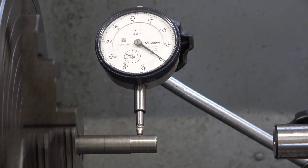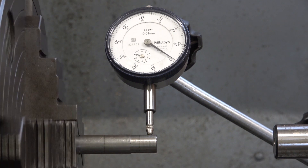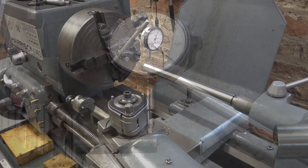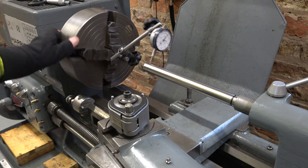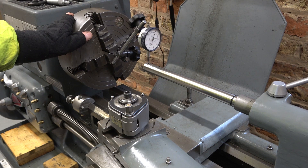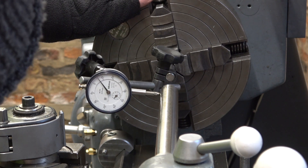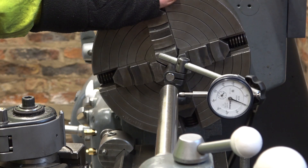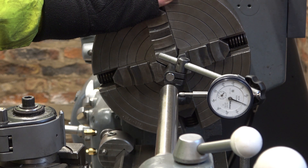Well that's better. Let's just move it along and see what happens. Even there it's run off a little bit but it's near enough. Okay, this is the setup and I'll look at the clock. I'll read those off: zero, six, six, nearly zero — one in fact. And what I'm counting is one hundredths of a millimetre, or 0.4 of a thou. So it's a little bit out.